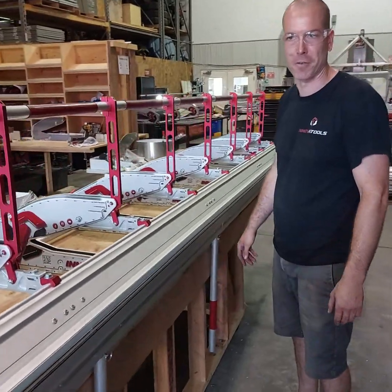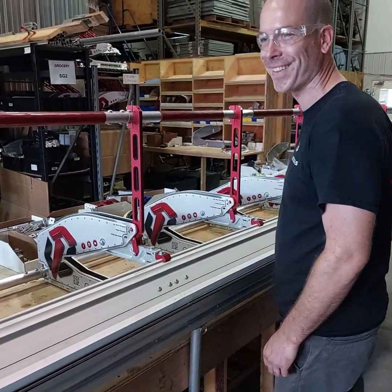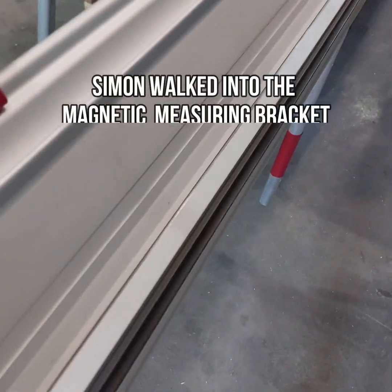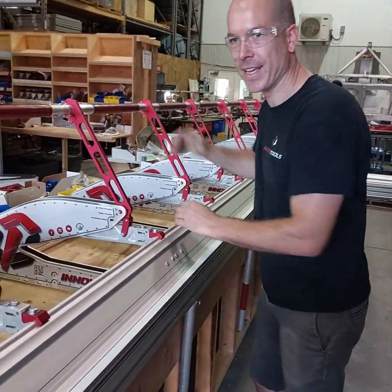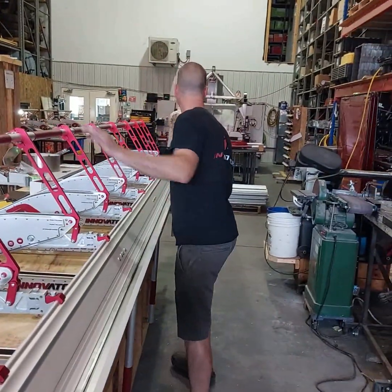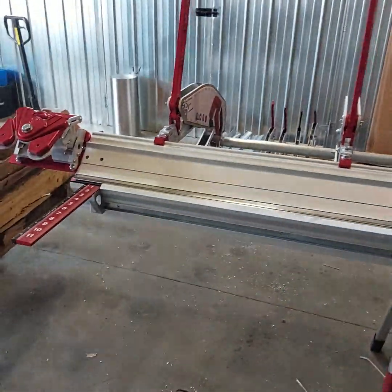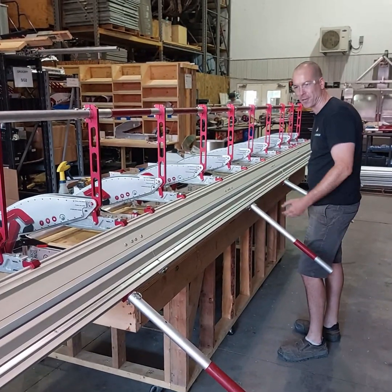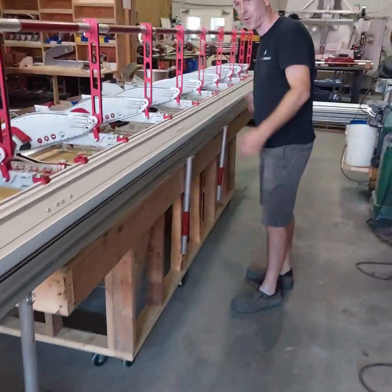I'll try and do a step fascia. We'll probably get somebody to line me up on the measurements at the other end, and I'll line myself up — I can probably even see from the middle. So we'll finish the hand bend from the middle of the brake. I'll do my inch and a half bend. I can see inch and a half here — inch and three eighths — let's go back to an inch and a half. Lock the brake. You'll notice we've got kind of a short angle, so that makes it more efficient. You have less bending to do than conventional brakes to get to your 90. There we are at 90. Check out how straight that is — that's so awesome.